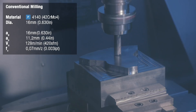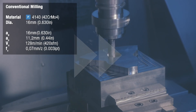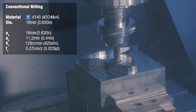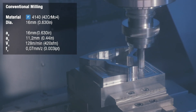In conventional milling, end mills need to run at lower axial engagement and higher radial engagement. This requires machining the workpiece in multiple steps and also requires the tool to run slower. See how we had to add a second step here?